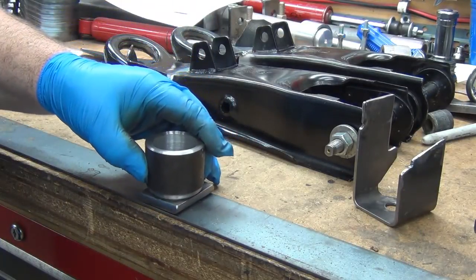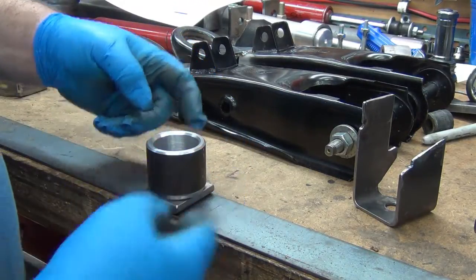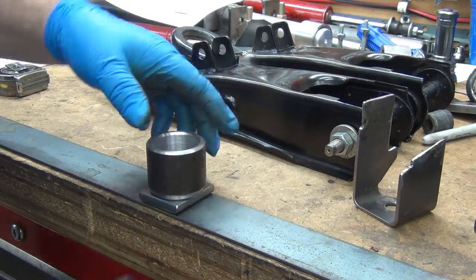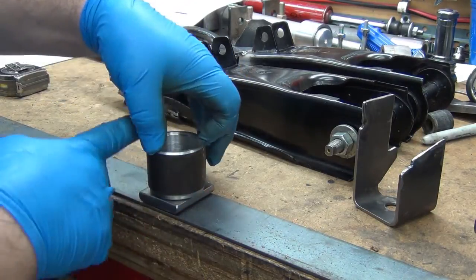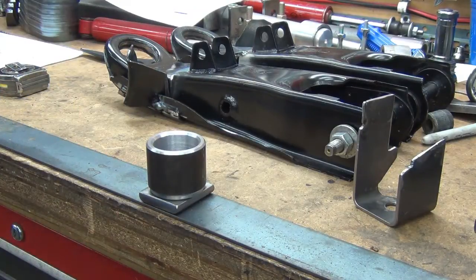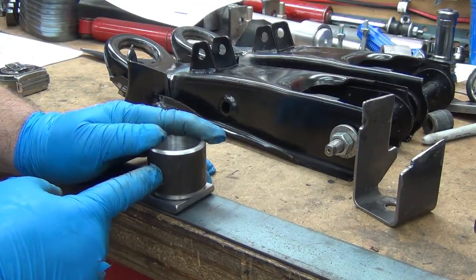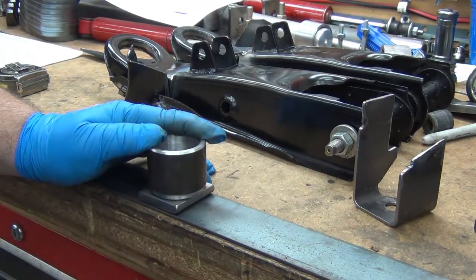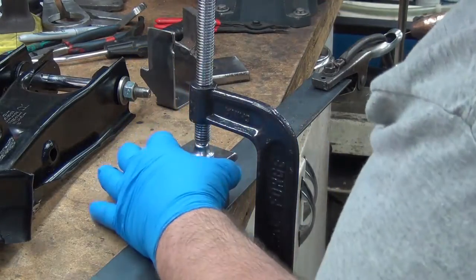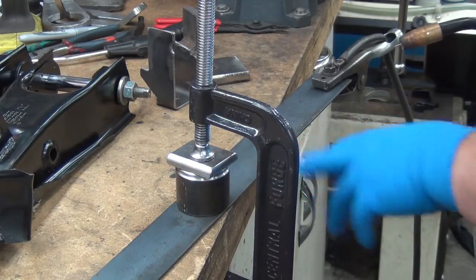This piece will go on top. I've got to get it fairly centered and then tack weld it. As you can see, it's going to be too wide, so I'm going to mill the sides off — I think it ought to be plenty strong enough. I'll probably drill and tap a hole into the side so I can put a thumb screw in there. A couple of tack welds here to hold it together, then I can machine the sides, and this part will almost be done.